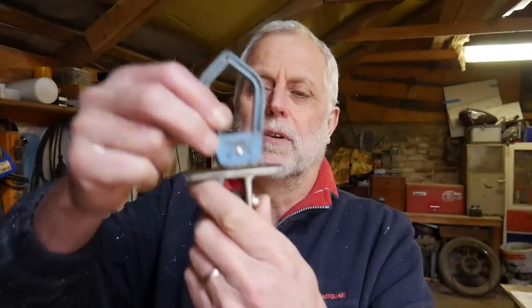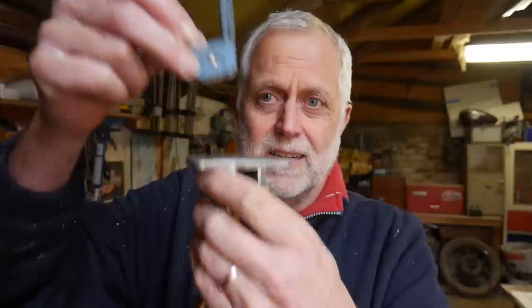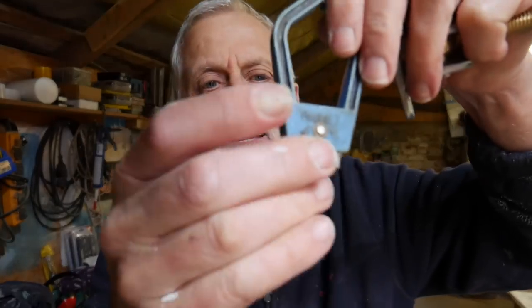And you'll remember a couple of weeks ago I had a bit of an issue where I took a wrong bit of steel and somebody commented, would a magnet have been helpful? And no doubt it would have done. Here is a magnet on my stainless fitting, and you'll see it doesn't stick to stainless, through all the marine 304 and 316. Whereas this, clearly a bit of steel, mild steel or whatever, sticks to that very nicely. So a magnet is a very good way of checking whether you've got marine grade stainless.